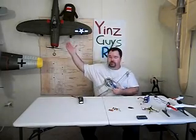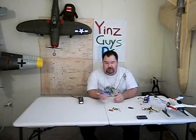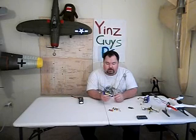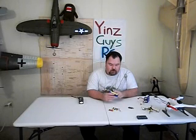So let's take our basic 3-cell 2200 milliamp battery. This is probably, where I fly in the Pittsburgh area, the most popular battery out there. This is the battery that comes with all of your E-flite type aircraft. Anything in that 40 to 50 inch range foamy is basically going to run on this type of battery. Now, this is a 3-cell, 11.1 volt, 2200 milliamp hours, and its output is 30 C.